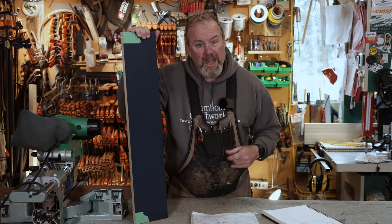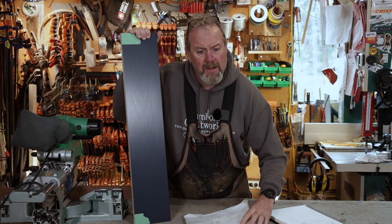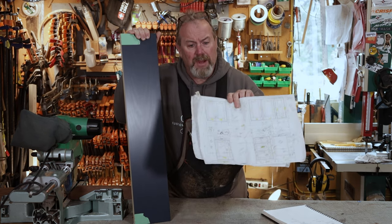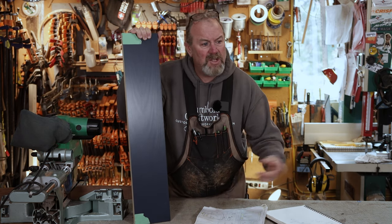The only thing I'm going to spray on this project is basically the doors, the face frames, and some trim — everything else is pre-finished and assembled after finishing. You've got to be a little careful but in the long run it saves you money, even though it costs more for materials upfront. So I'm going to redo the plans, make a cut list, and start milling all the solid stock, face frames, and doors.